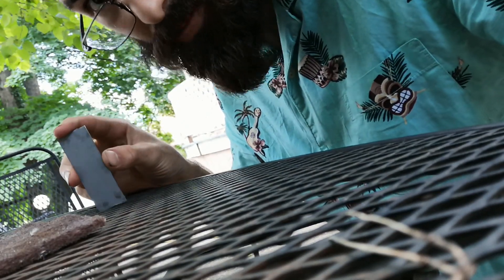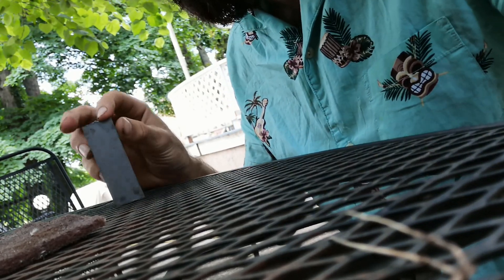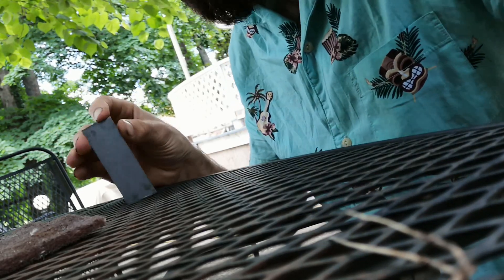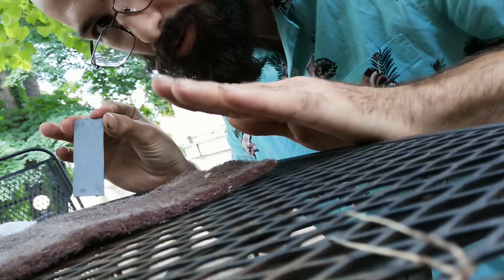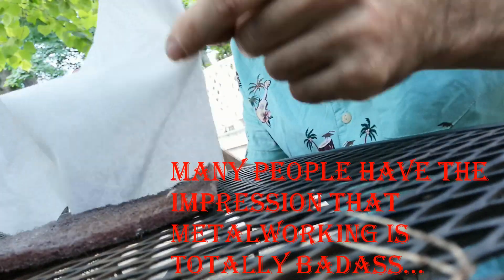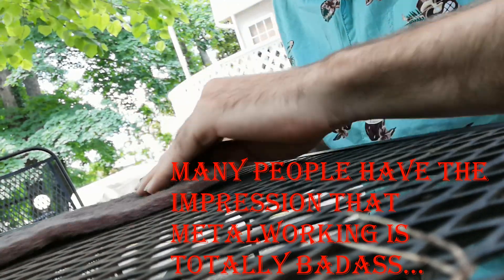Alright, next step is just wipe down on my little plates. I don't know how much play I really have with stainless steel. Carbon steel you have a little bit of leeway — if you have some finger oils on there, it'll still weld. But stainless steel I'm gonna assume I have no room to play around with. So I'm gonna scotch-brite them all pretty thoroughly, and give them a wipe with some isopropyl alcohol, make sure they're very nice and thoroughly clean.